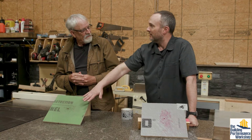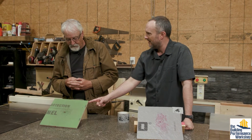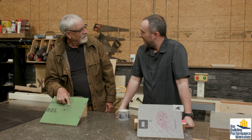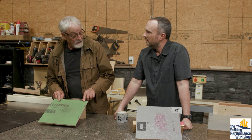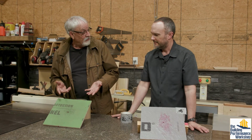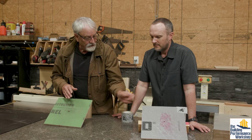If you're going to use something like Grace or some other fully adhered membrane on the top, especially something like butyl that's going to self-seal around nail holes, would this need to be Zip, or could this be just a 1/2-inch OSB or a 7/16 for that matter? Yeah, it could be whatever you want. The Grace is going to stick to this better than it does OSB. Really? Yeah. Okay. Rule of thumb in developing these products is all you really need is a surface that tape will stick to. And that's what this and this did. You create a surface that tape sticks to, you're 99% there. The other thing is you've blocked off all those voids.